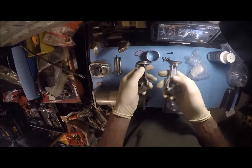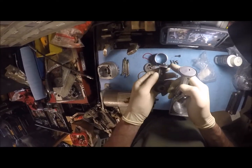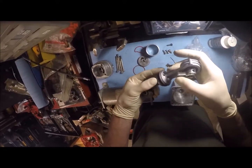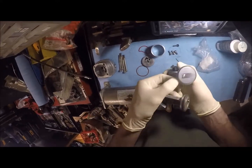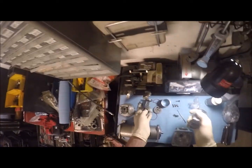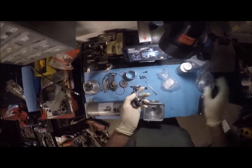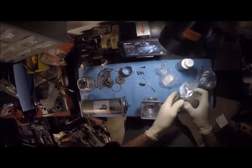This is a 480C replacement connecting rod, and this I want to say is an old style 480C, or I got this off another compressor. They both are about the same, but look at this one. This one is way bigger. It's a brand new seal, so the seal's out a whole lot more, and you can see that too here in the cupping design, whereas this seal's kind of crushed in close. I'm not sure how much these independently run for, but the kit itself, the cylinder, here, let me pop open this so you can see everything.